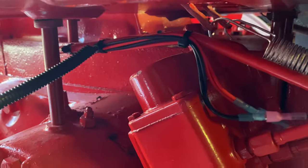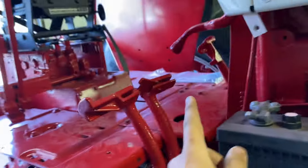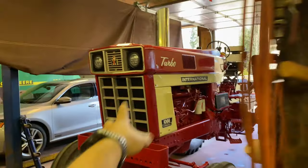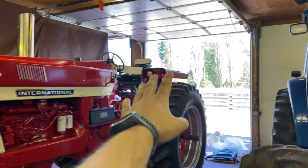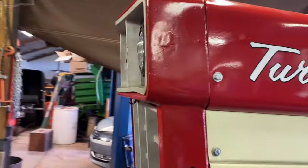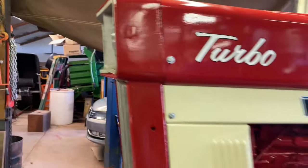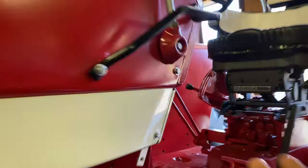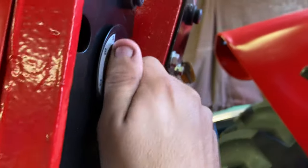They hook up right here. Now there are two power wires for a reason — on these tractors there is a switch position which I'll show you. It turns the headlights off and keeps all the lights on the fenders on. If you switch it all the way up to 'R,' the fronts are off, and I have it wired to turn the rears on. Then switch it back down to 'B' or 'D' and you've got all the lights.